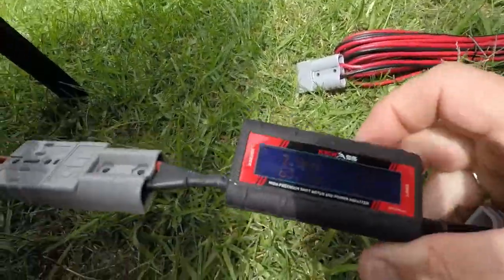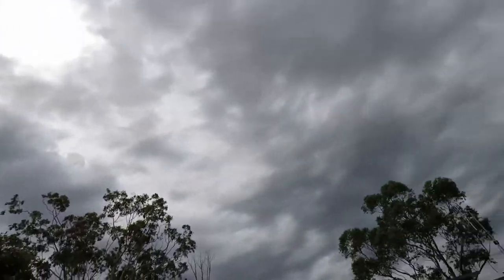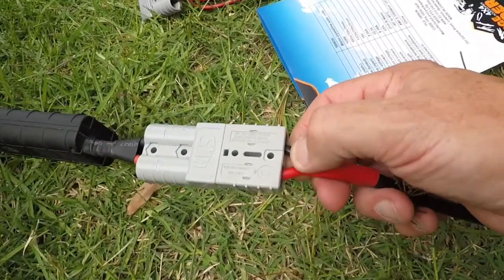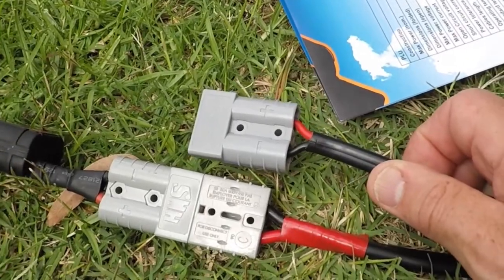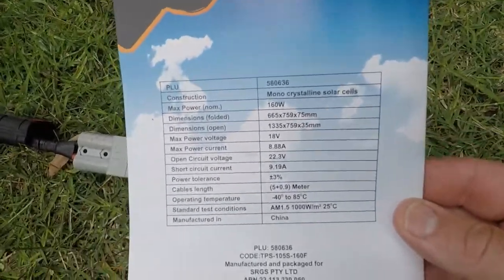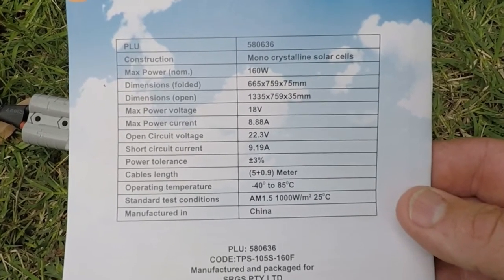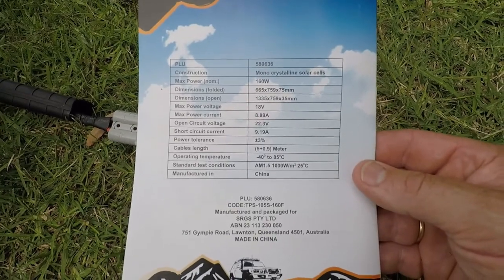Pretty good quality. It's a cloudy day in Victoria, on the road, but we'll give it a go and let you know. The sun's just peeking out at the moment. The 5-metre cable here is from Ridge Rider as well — super cheap — and as you can see it is pretty heavy-duty compared to another one I got, which has thinner gauge wire. Thicker wire means less voltage drop, as I'm sure you all know. On the back of the manual: maximum power current 8.88A, maximum power voltage 18 volts, short circuit current 9.19A. Pretty happy — we'll see how we go and I'll keep you updated.